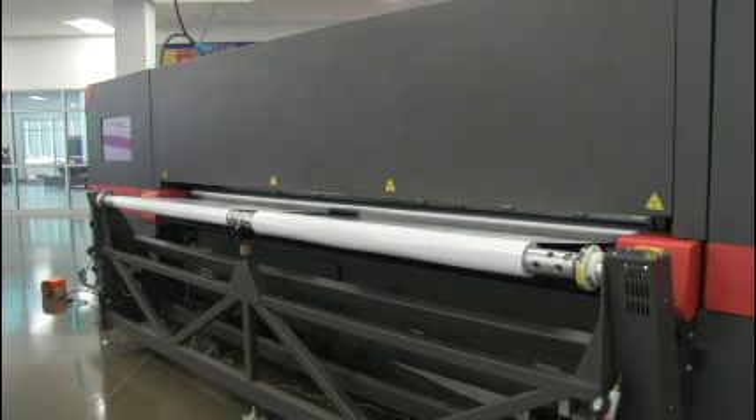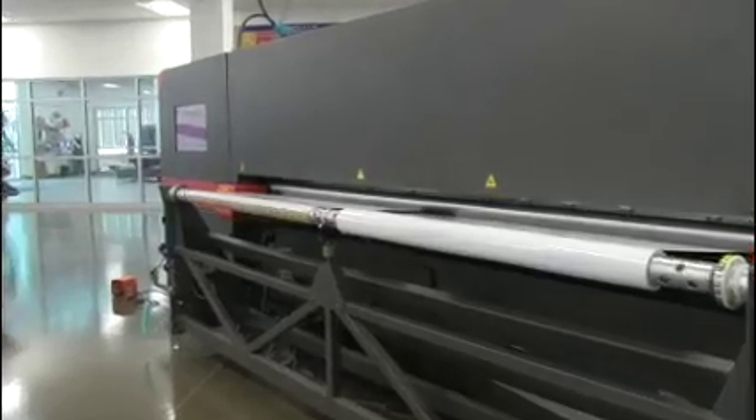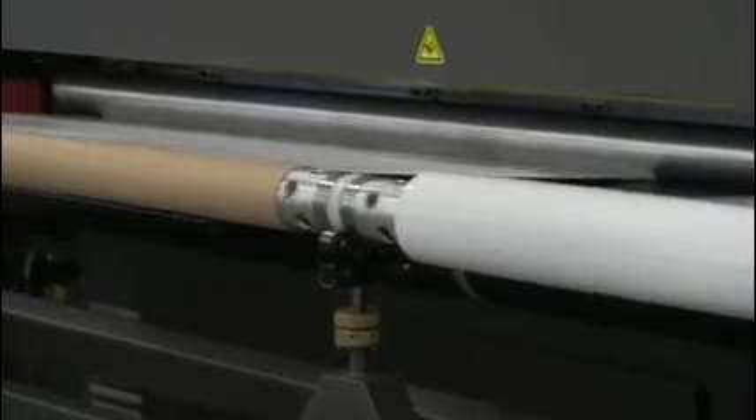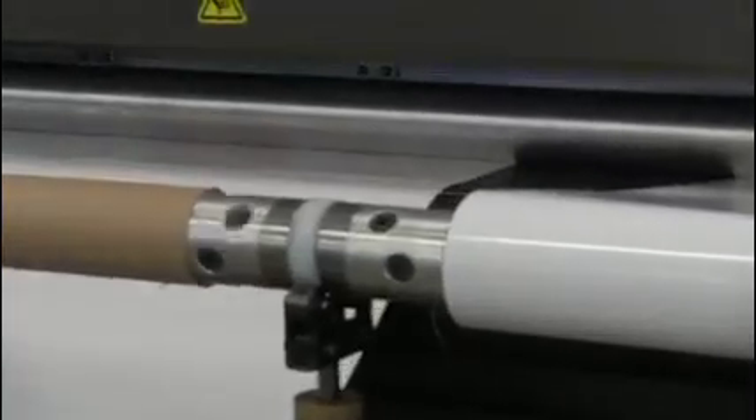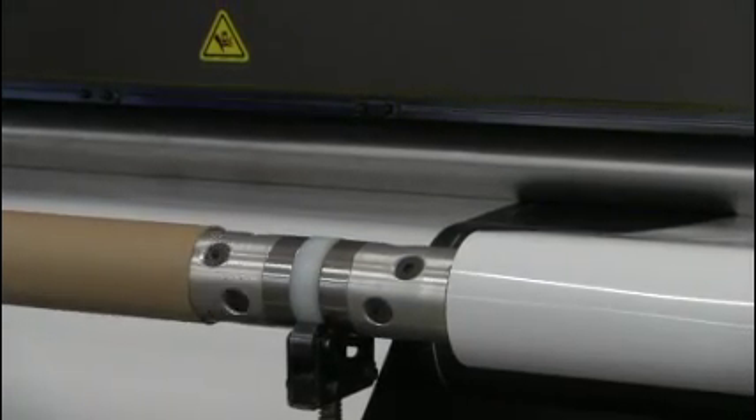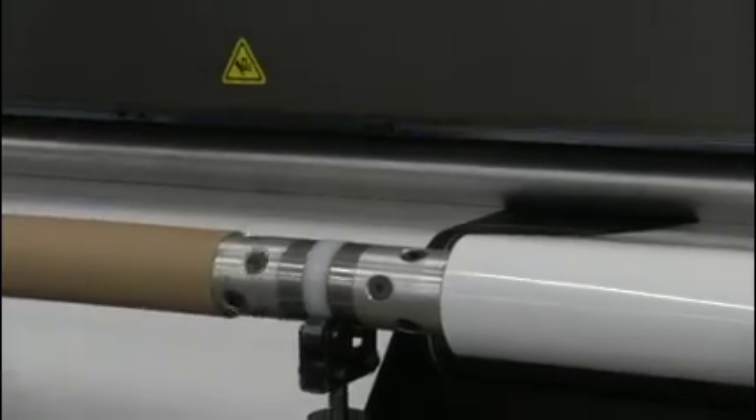What you saw there was the print on one side was completed, so the material rolled backwards to get to the very first print line and then actuated another print — simulating some starting and stopping. Now we're at the end of the roll, and this is exactly what the split shaft should be doing: this one is rolling independently while the other is still running at normal speed.